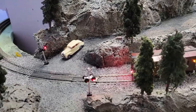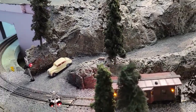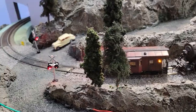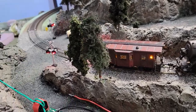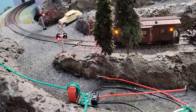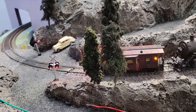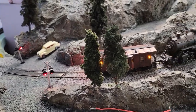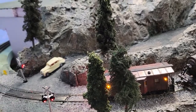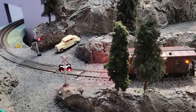All right, solved the flicker problem. So I actually spent several hours on this, trying to go through and add keep alive circuits to the light-it, which apparently only works if you're using it as a mobile decoder. We are using it as an accessory decoder. I just could not get those capacitors to work. So, the capacitors that I talked about earlier are not valid for this scenario.